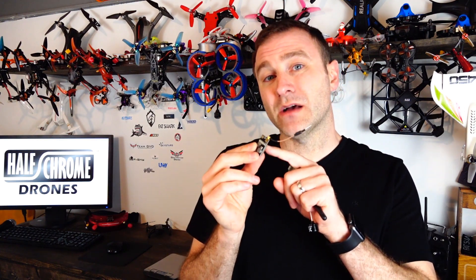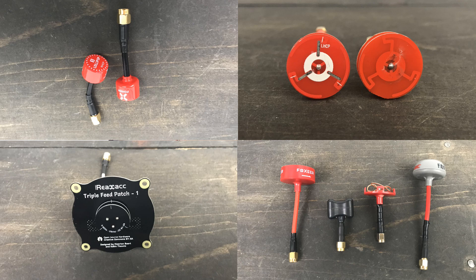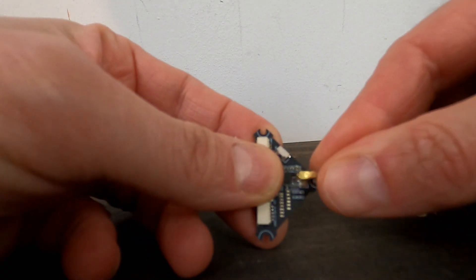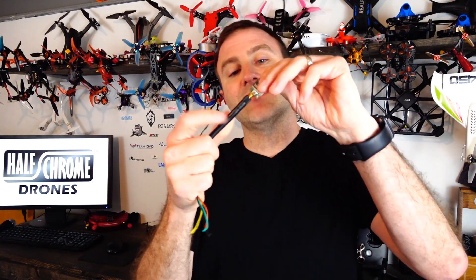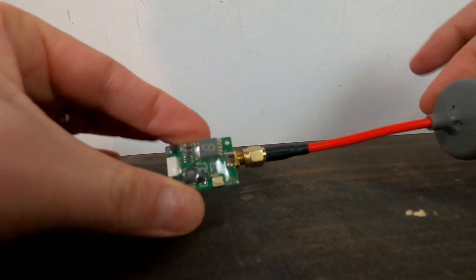A lot of people think all the quality comes out of the video transmitter, but the antenna might be just as valuable in terms of reception. I've done a whole video on choosing the right antenna — check the link below. You'll also notice there are different connectors. The MMCX connector is probably the preferred method for most small quads. The UFL is the standard tiny whoop connector, but it comes loose easily in a crash. If your antenna is not connected to your VTX when the power is on, that's the easiest way to fry it. Tip number one: never plug in your quad if the antenna is not on. The SMA or RPSMA connector is the bulkiest and adds the most weight, but it's probably the best connection.